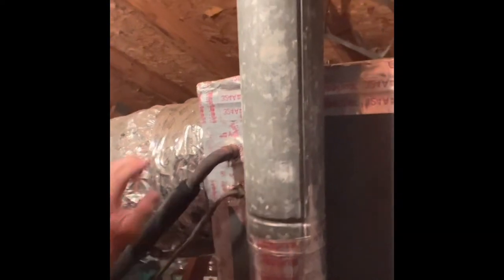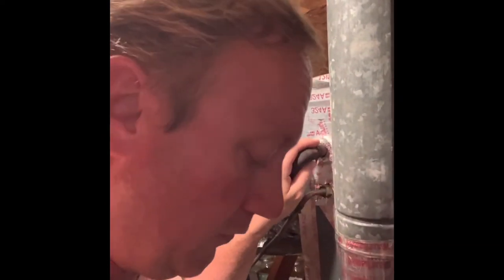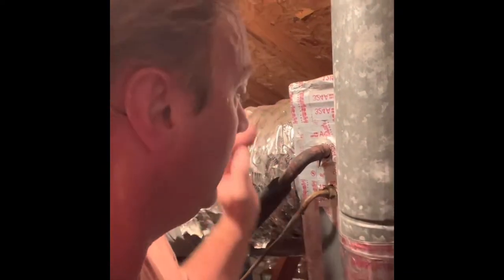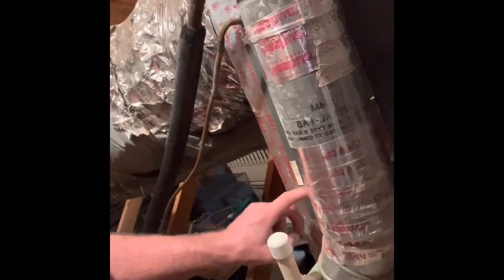This is your low pressure line and it's already starting to feel a little bit cooler. This is your high pressure line. The way it was described to me: the low pressure line outside should feel bottle-neck cold — like a beer bottle when you take it out of the fridge, where it condenses just a little bit of moisture on it. This line is already feeling cold. I notice a little bit of an air leak around here so I probably need to tape that up. This is your air handler — the top part handles the air before it goes out to the ventilation ducts, and this is where condensation inside the air handler drains out and goes outside.